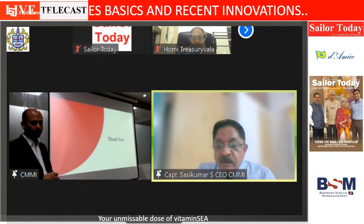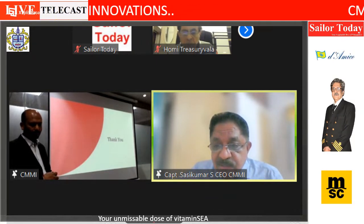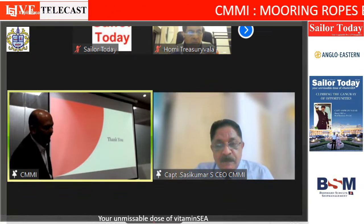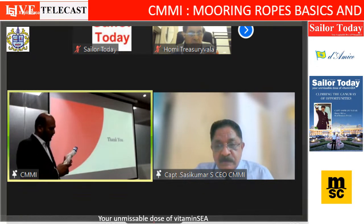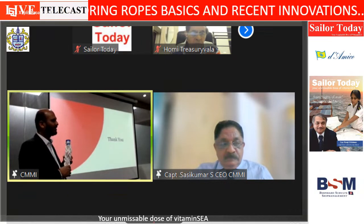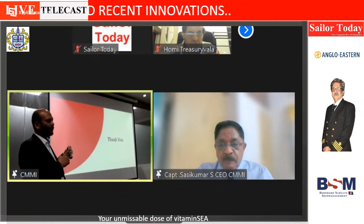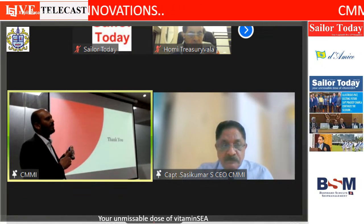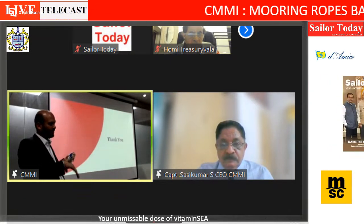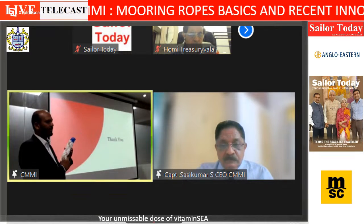Right. I did mention there was somebody who missed the initial part of the lecture. Is there any technology that restricts the snapback when a mooring rope parts? Okay. So just a quick recap. There are two technologies being used. One is from the western part of the world, wherein a 12-strand rope is there and they insert a core inside. So that when the rope breaks, the core comes into picture. The plus of that is, it's a good technology, no doubt. The rope just stays there.